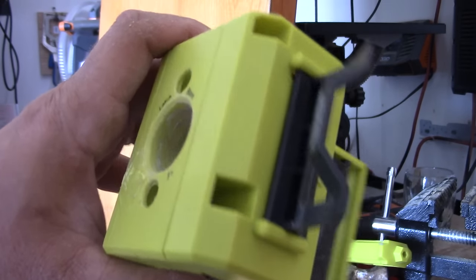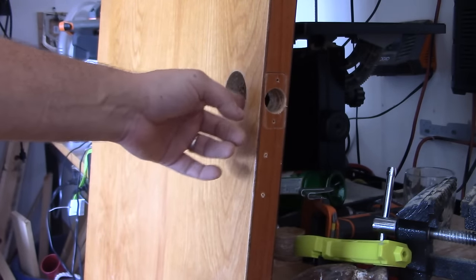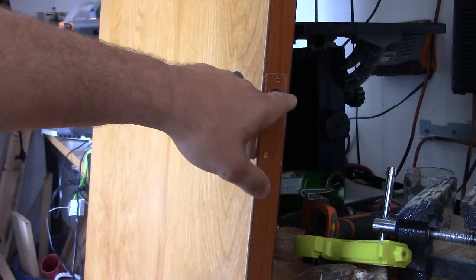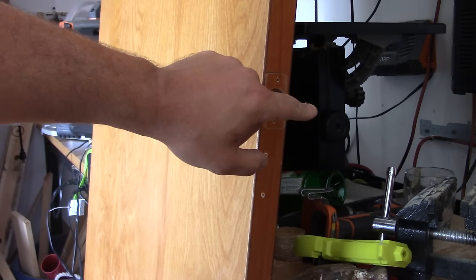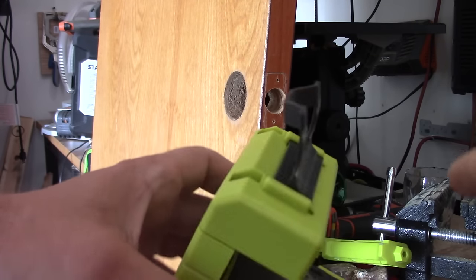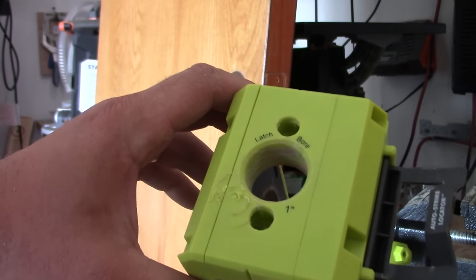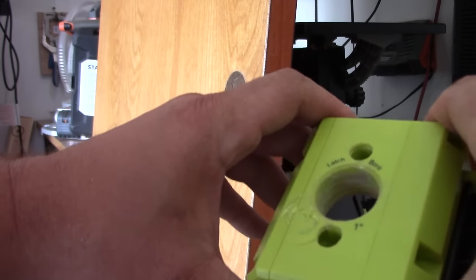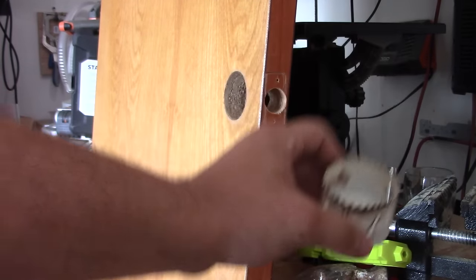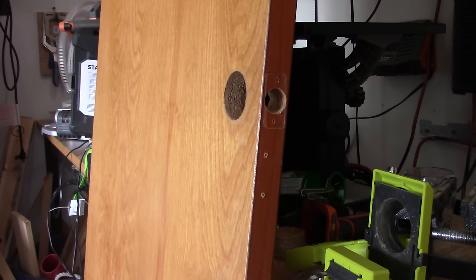If I were to review this, giving it a one being the worst and five being the best, I'm going to give it a four — a solid four — just because it does make some really nice holes, it cuts out really nice, and it gives you everything you need. As soon as you get it home, you're ready to go and all you need is a drill. By the way, this is your strike plate locator — I never use this; there's an easier way. Once you get that doorknob and latch in, put some silicone at the end of the door latch, turn the deadbolt or lock and it'll strike where that hole should be. Then just use a drill bit or borehole saw to open that up. All in all, not too bad. If this video helped you, thumbs up, subscribe, comment below, and check us out at www.toolreviewzone.com.